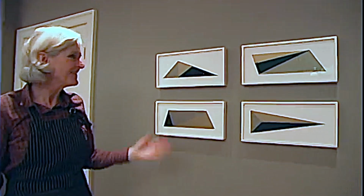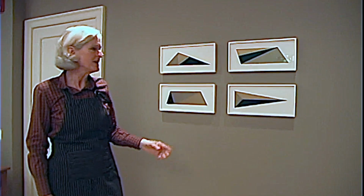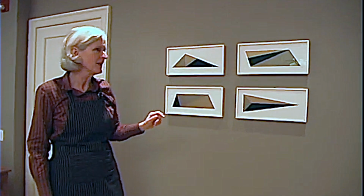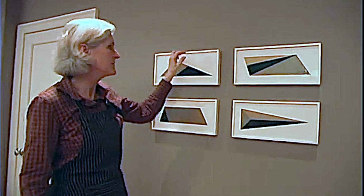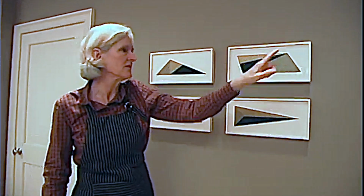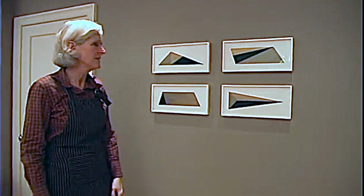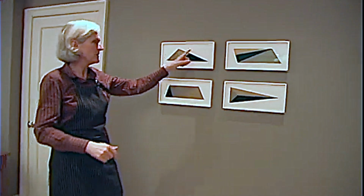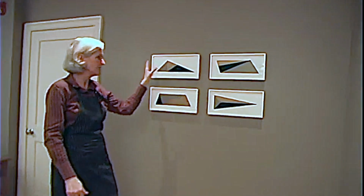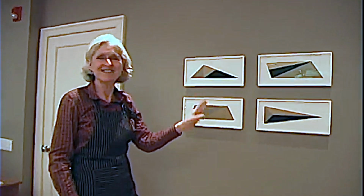So as you can see, we were able to successfully hang 4 pictures perfectly level, and they will stay that way now because there's 2 hooks on each one. If you were to hang 3 or 4 in a row, you just use the same principle with center to center, center to center, center to center, down to the bottom one, and measure to either side of the center points because it's a lot easier to find your center points on each set of nails than it is to measure the nails individually. So good luck. It's not as hard as it looks, and it's well worth it. It's a beautiful result.